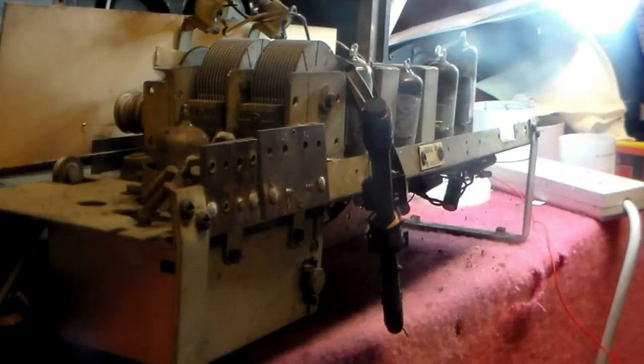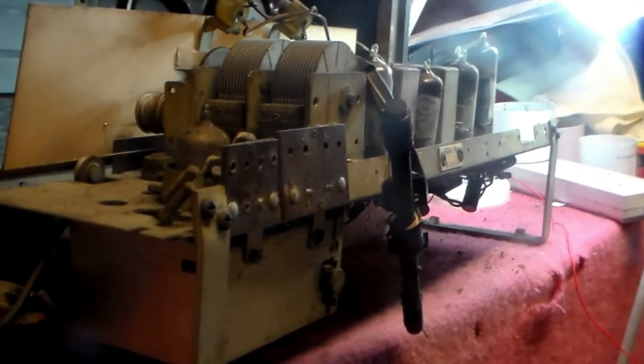The next thing now is the dial bulbs. I've got the set up now, correctly, although not in the case yet, and I'm going to sort the dial bulbs out now as well. Now, the two dial bulbs in this are in series, so if one is bad and one's good, they'll both be out. The one that's in has been tested, it's good, but this one is bad, okay? So that one, I'm afraid, is only fit for the bin, which is where it's going to go.